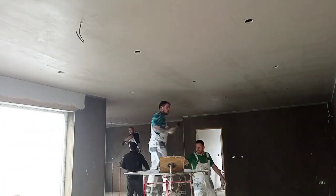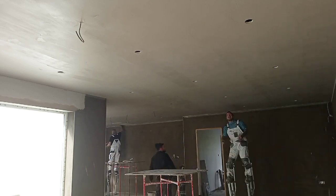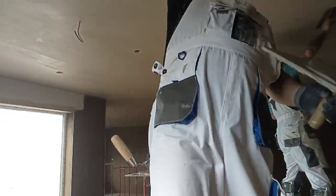So the sparks have been and they've cut out the holes for their spotlights. So between every coat and every pass, we use a wee pointing trowel and cut them out. This saves any drying skim from being pulled across the ceiling.